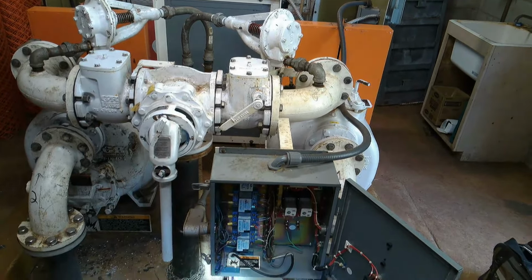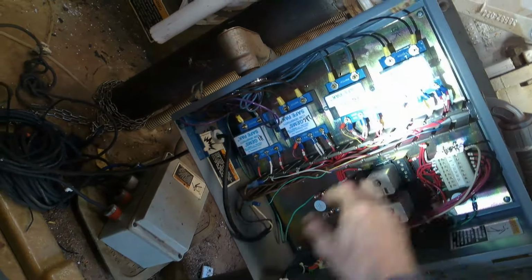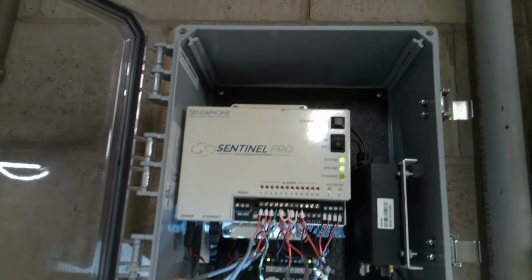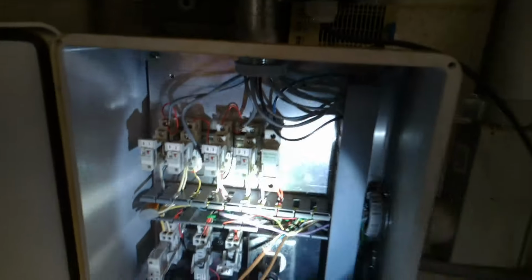Let's jump out the lag and see what happens. And let's verify. So that multi-conductor cable has a brown and then it has a red on the lag relay, this wire right here, a red. And that red in our multi-conductor cable comes over here. And it goes right onto this interposing relay, which is what it's supposed to be, lag float D3. And then from there it goes up and goes into input 3. Good. So what is the common for that voltage to fire it?